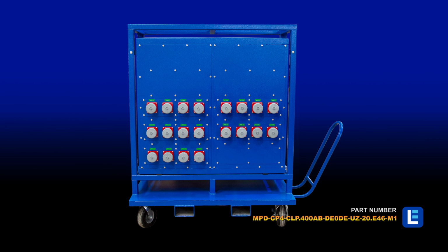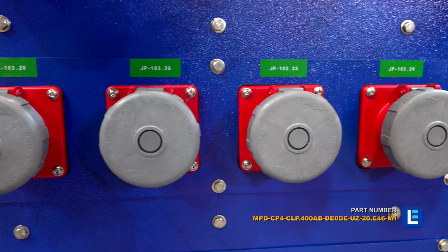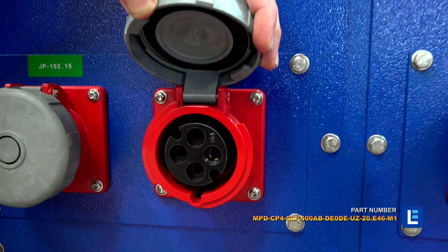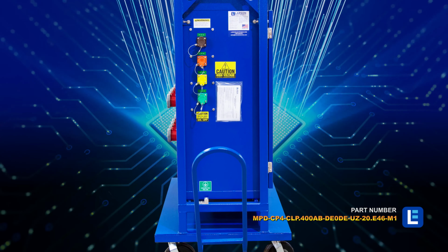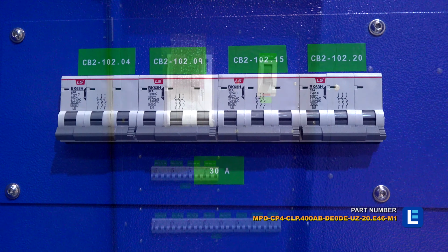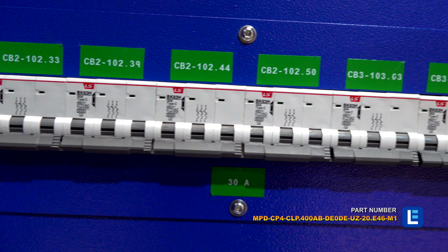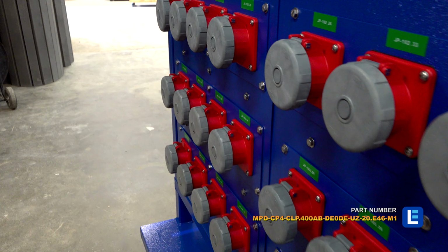This power distribution system offers 20 432R3W IEC 60309 pin and sleeve receptacles. This temporary power distribution panel is fully enclosed and is ruggedly constructed to withstand demanding conditions and industrial applications. The system is accessible via front locking doors for access to breakers on the panels. The receptacles are side-mounted to the enclosure and provide weatherproof flip covers.